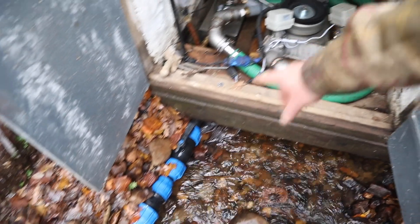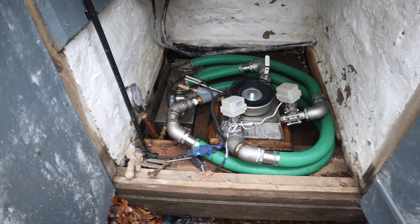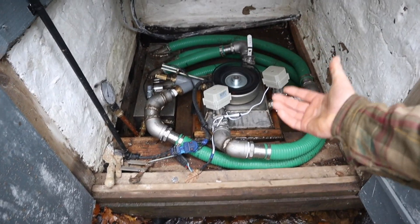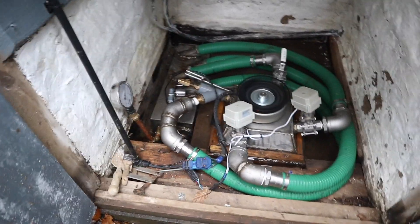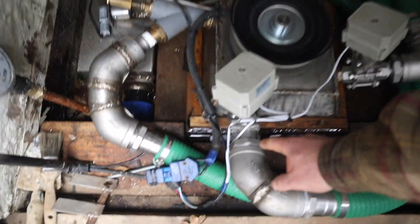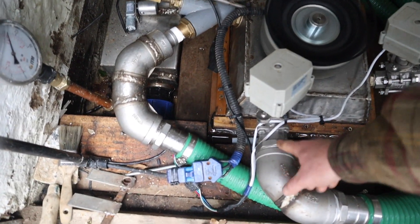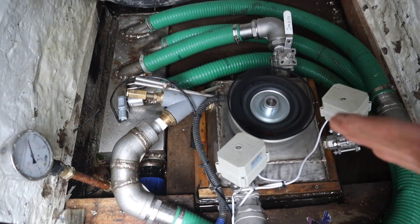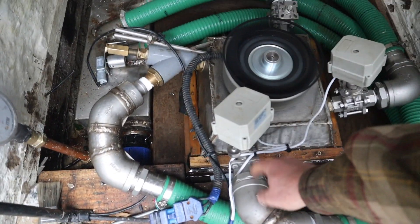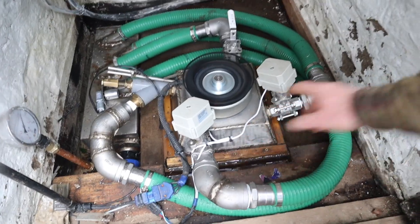The biggest question people have is about losses in the small pipe leading to the intake. I've been doing some calculations — I don't have huge losses, but we're trying to fine-tune it and get it as economical as possible. These fittings here, where it goes from two-inch to one-inch pipe, have quite significant loss. Considering I have three of them, those are worth changing. I'm going to machine some tapers to insert into these — I think there's potentially 10 to 15 watts to be gained there.